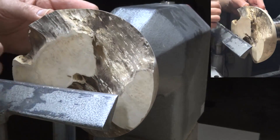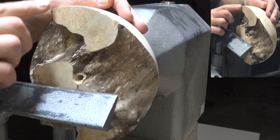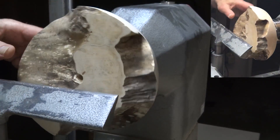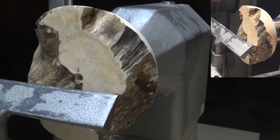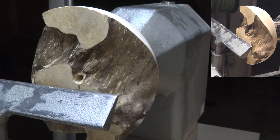Maybe out this far — and I need to take a little bit down on here. There's some chipping, so I'll have to face this off a little bit as well. I'm going to turn this at 1,000 RPM, and I sure hope I did a better job of tightening the chuck in that recess than I did last time. I won't need another fail right away.